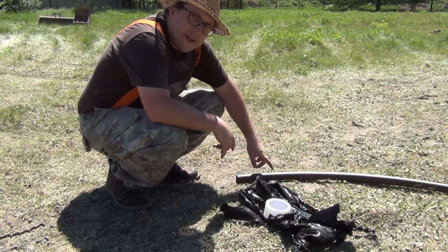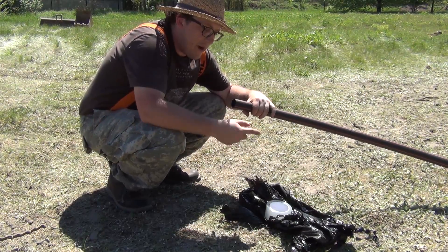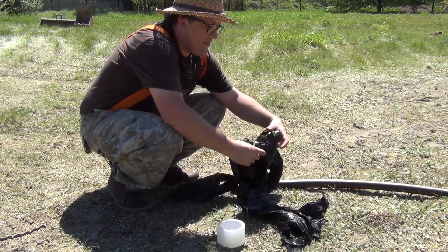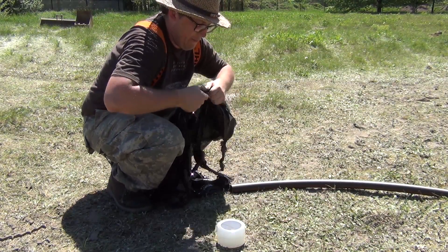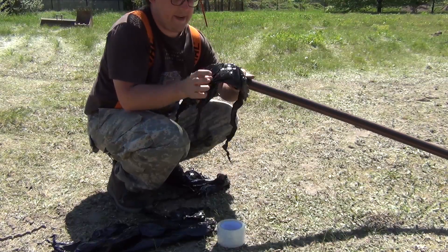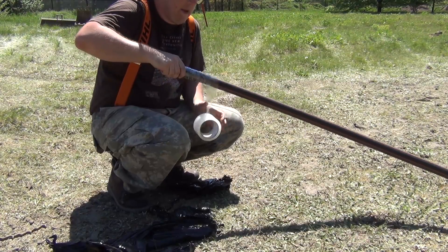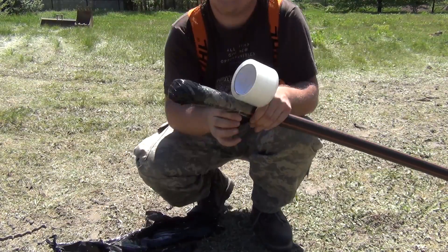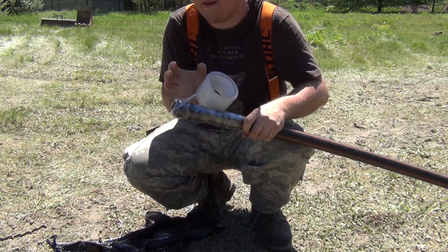We are preparing to lay these pipes underground. Because I don't have many caps for them, I'm going to wrap some foil around them so they don't get full of dirt and sand. I just have some of the black foil they came wrapped in — I'll tear a piece and wrap it around the end, fold it in half so the end is protected, and then make sure to get some tape on the bare pipe so it doesn't come off easily. And there you go.